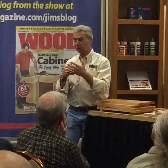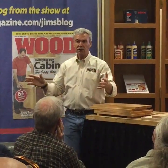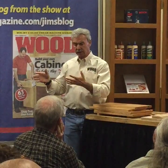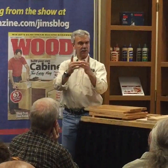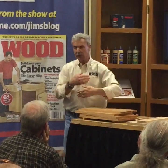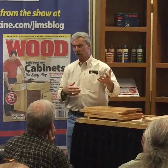The other problem I have with it is joiners have a formula, an unwritten type formula. The longest board that is relatively easy to join on a joiner will not exceed 50% longer than the bed of that joiner. So in my case, I have a 6-inch joiner, it's got a 6-inch cutter. It's got 2 feet in-feed and 2 feet out-feed, normal type joiner. So if you add 50% of that, you've got a 6-foot long board.